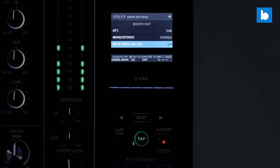Then we have the mic options themselves. There's mic to peak limiter, you can send it to the booth peak limiter, and the mic-to-record-out will exclude the mic — so you can record without the mic on the record output, which is really nice if you're trying to capture your set. And there's phantom lock, so you can lock the phantom power so it can't be turned on by accident and start feeding 48 volts to a microphone that can't handle phantom power.